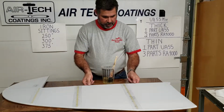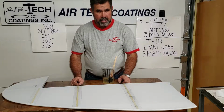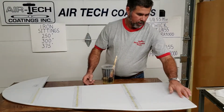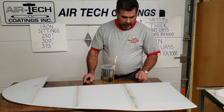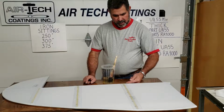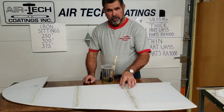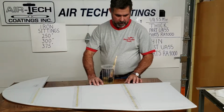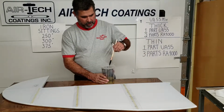And if you're fixing to put this leading edge around here, I like to, at this point, only do these, because you'll get ahead of yourself and say, if I were to get this one marked, this would be an okay one to go ahead and glue. Actually, you would need to do this one and go ahead and glue it. What you'll do is when we get ready to lay these tapes on and we cut them, say, up here to the edge, when we lay this other piece of tape around here, the top of that's going to need a little bit more glue, because remember, we put down 2 thin coats. We're going to need a little bit more glue on the tops of those tapes. So instead of gluing all this and having to remember to come back and glue on top of our tape, I like to just do whichever pieces I'm in the process of doing.